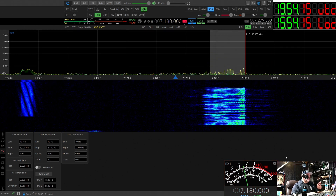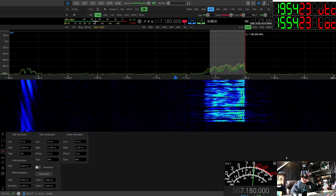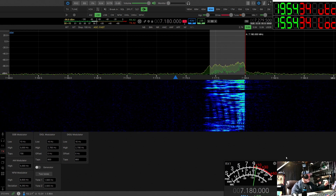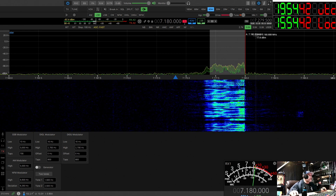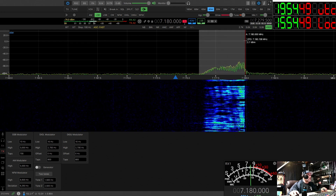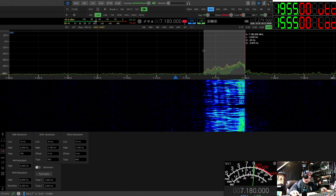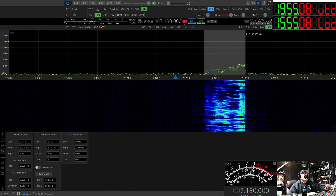I don't see any reason to go up to 4k even on an uncrowded band necessarily. From my prior notes I think that thing really was going up to maybe about 4200 on the high end, which is plenty wide enough, especially for my Yaesu radio. I have a 7610 and some of the frustration on those radios — I also have a 7300 sitting next to it — ICOM limits everything to their 100 to 2900 and they have pretty tight skirts. I don't think they go above that on a scope at all. I'm happy with the Yaesu — it gives me the ability to play with this. Back to you, AC10, from W3ZG.